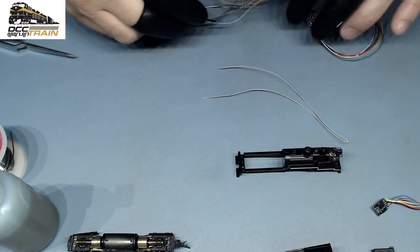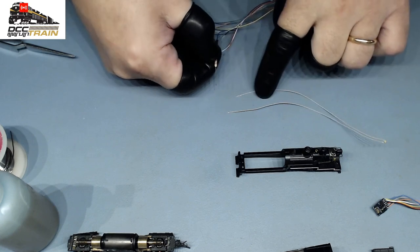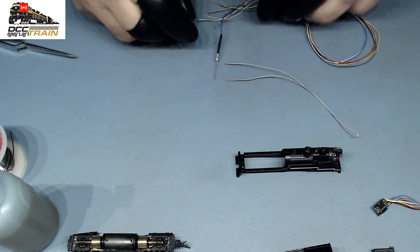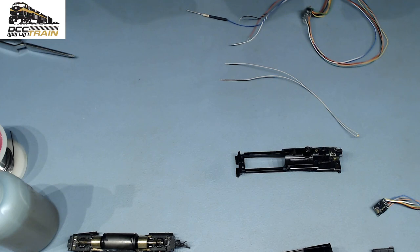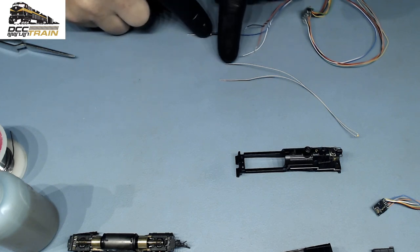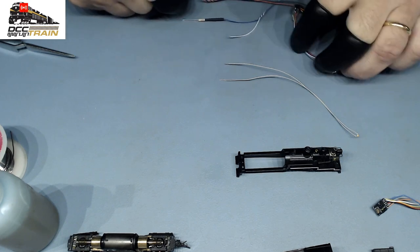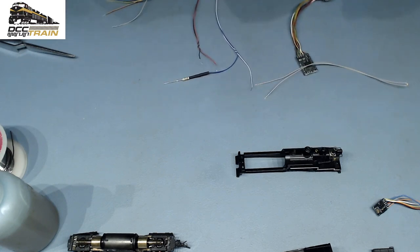So now I have the insulated leg of that resistor. I think it's 680. Okay, my two legs, my two wires here. If it's crossed, I don't mind, because it's not going to do anything to the decoder, damage the decoder. But if this leg accidentally touches the signal out of here, or one of the guys from the track, they won't be connected straight to this application, right? So I put them on the side, and I'm putting on my output of the track and testing them, which I'm calling signal.